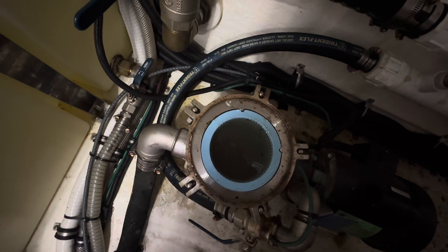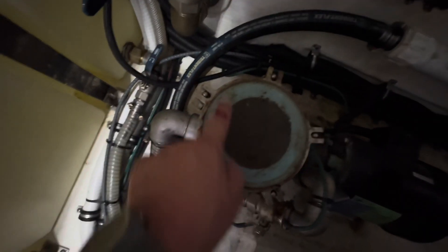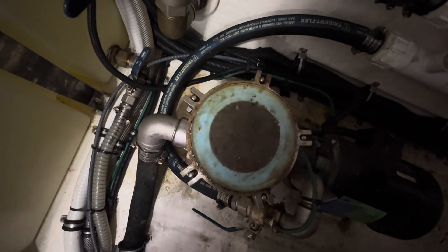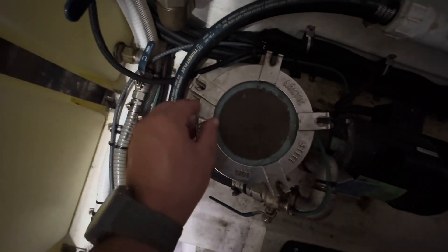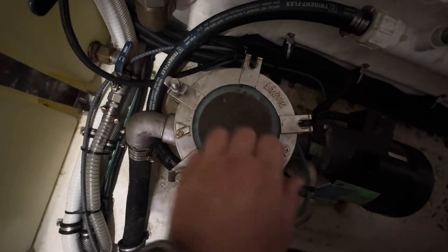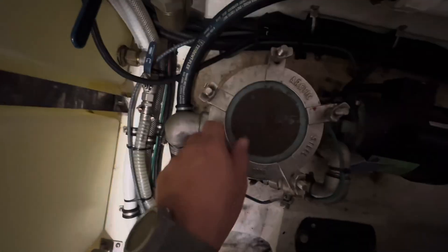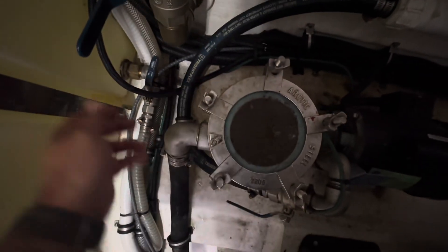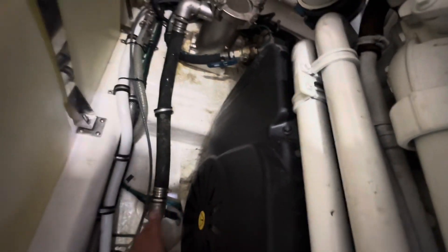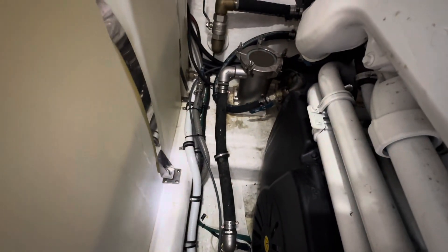So we'll come back with the gasket, and these are kind of tricky — you have to make sure everything's centered. You can't just slap it on there; you've got to make sure everything's centered and laying in its track so it won't move around. Put this ring back on and make sure they're snugged up. Everything's good. We can turn the discharge back on, then turn the intake back on. Check for leaks — nothing's dripping, nothing's draining. Everything's good.